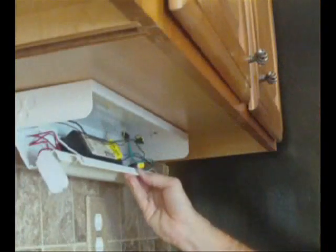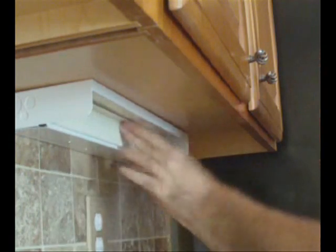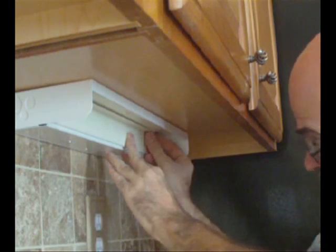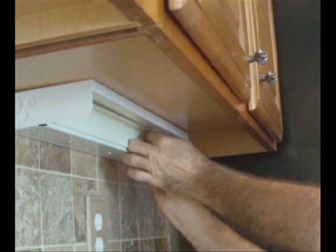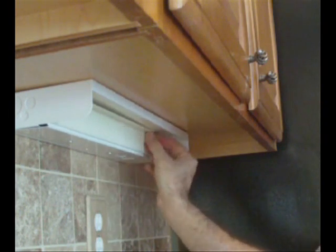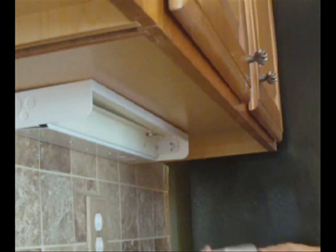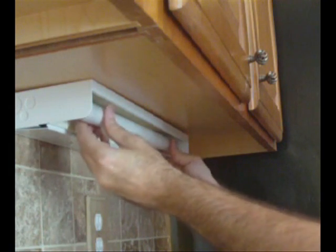Now we're ready for installation. All the wires are connected here, and we're going to go ahead and tuck every piece of everything inside. There is a bolt that's hanging out here, and I'm going to put a nut on this, and this will secure the fixture together. Now we take the light bulb — it's got two prongs on both ends, and right here it's got a groove where it flips in. I'm going to take one prong at a time, one each side, push it all the way in, and then twist it until it stops.